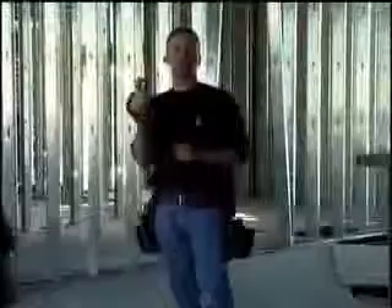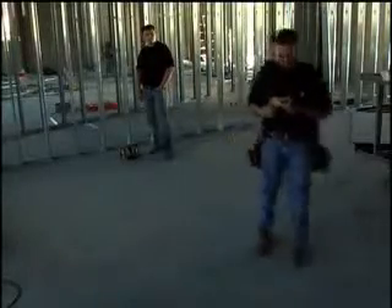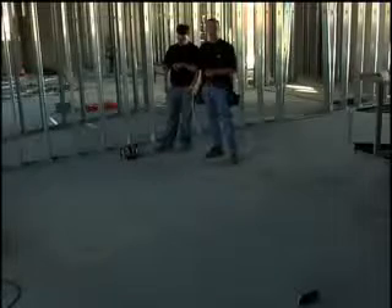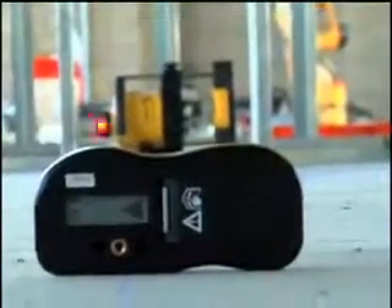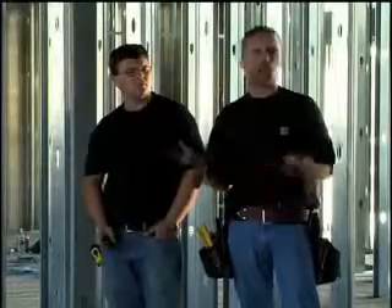We've developed an easier way of doing it. This is a laser receiver like we've showed you with other lasers. These receivers can also be used inside vertically. I'm going to take this black mark here and put it on the chalk line. What Dan would normally do is adjust the laser until he gets an even tone, but now with our laser he can do it with a remote. On the bottom of the remote there are two buttons. He wants the laser to move to the left, so he's going to push the arrow button that aims to the left and adjust it until he gets an even tone. What he did is he actually steered the laser plane over and locked it onto our line. Now we're ready to build our wall.